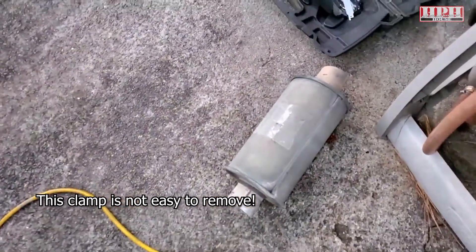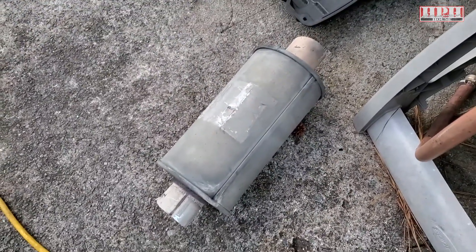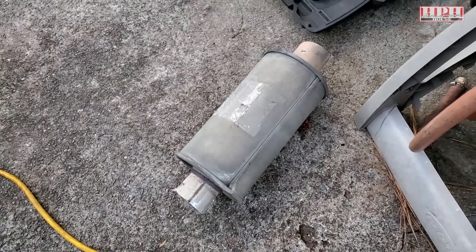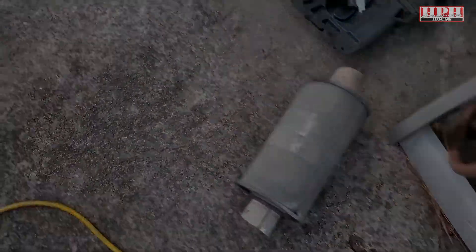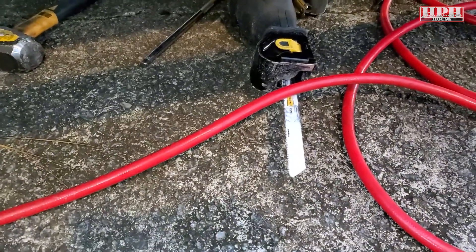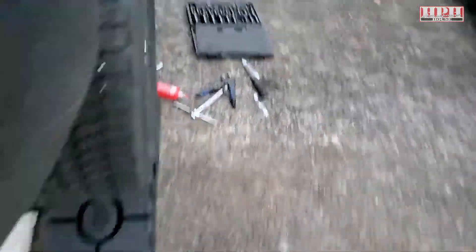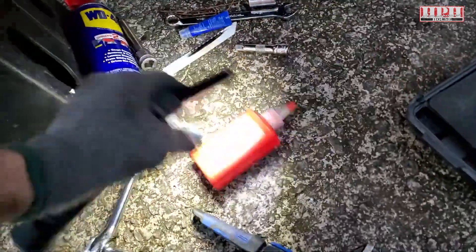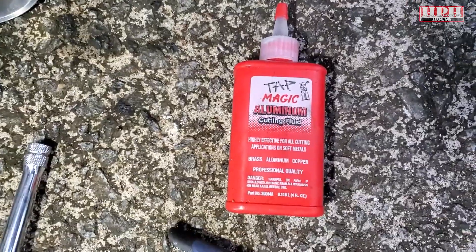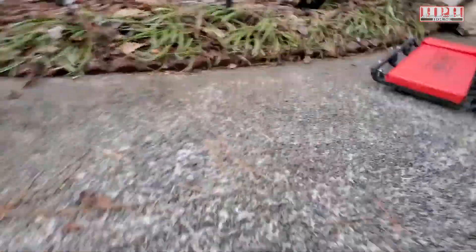Removing this stuff was not the simplest thing. Be careful — don't have your head underneath while cutting because it'll fall and clunk you. You'll go through quite a few hacksaw blades, so use some cutting lubricant while cutting through. If you've got to cut through bolts, use something like Tap Magic — very handy stuff for cutting through things.